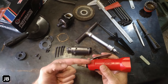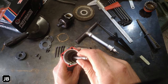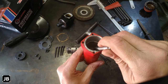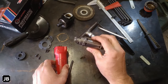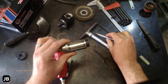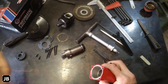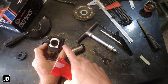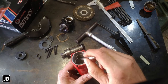All right, so I don't know if you guys can see in there. You've got your air coming in through your valve assembly. We'll check what's inside there just now. And over in there, there's a little seat there. So what will happen is you've got your rotor assembly. Air intakes on that side, goes through the rotor, comes out on the exhaust ports. Chucks everything out front. Some of it goes into the gear assembly. The rest of it bypasses into the exhaust port sitting there.